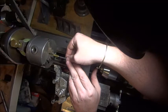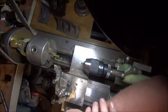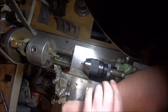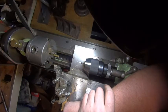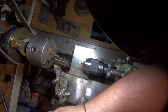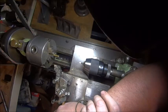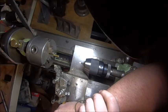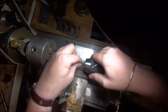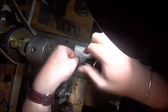That's a pretty nice fit, so I'm pleased with that. That's how that's done - a bit of a look at the D-bit and how to make one. That's going to drill brass very easily, or aluminium, if you keep plenty of oil on it and you run it fairly slow and pilot drill it - you won't have any problems at all making a hole to size in brass or aluminium with a tool like that. It'll give you a pretty good finish and precise, to-size measurements as long as you get the flat exactly halfway through the diameter of your material.